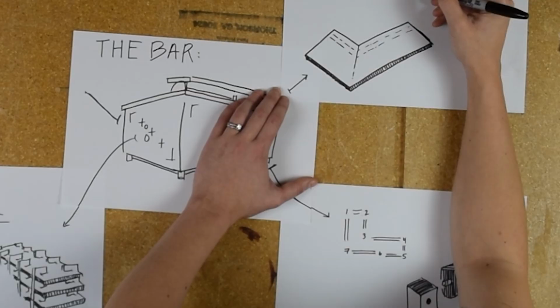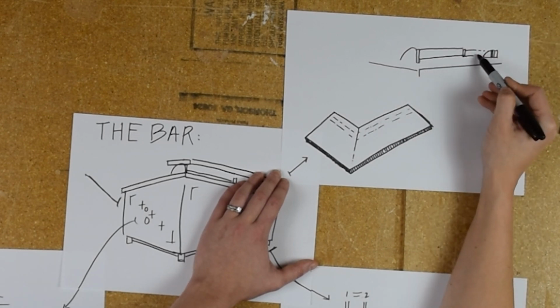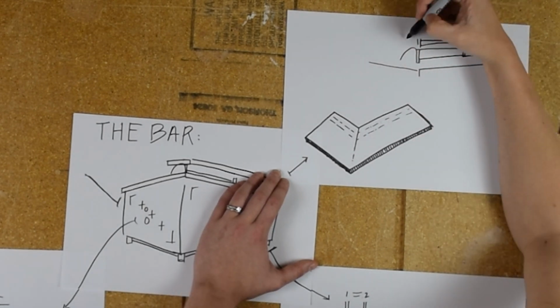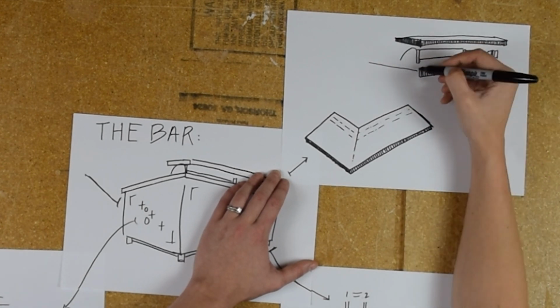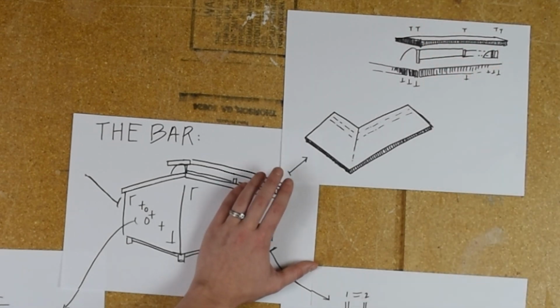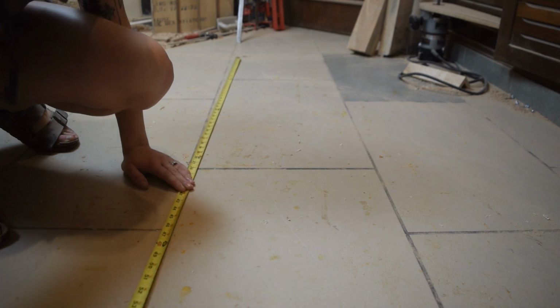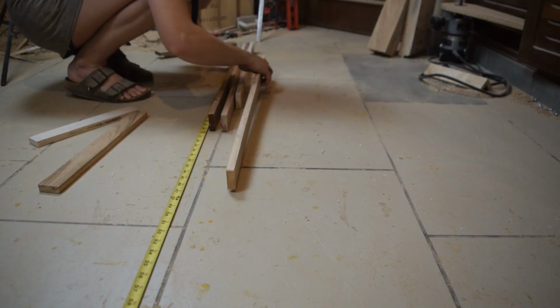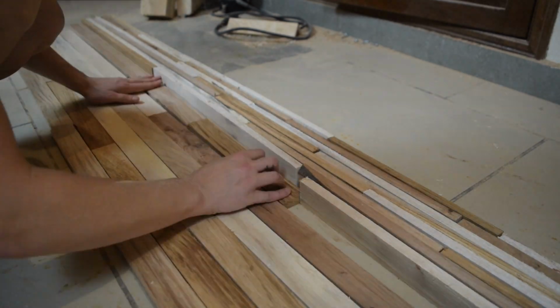While that dries, the upper countertop will sit atop 3 curved supports, joined by 2 skirts that will sit in slot joints in the supports. I'll use a series of sunken screws through both the top and bottom countertop to the supports to connect them, and then plug all visible sinks with some 1/2-inch plugs. Again, the upper countertop design was a bit of a happy accident. While trying to fix the bottom counter problem, I ended up ruining the lumber I set aside for the upper, so a kind of butcher block it was.